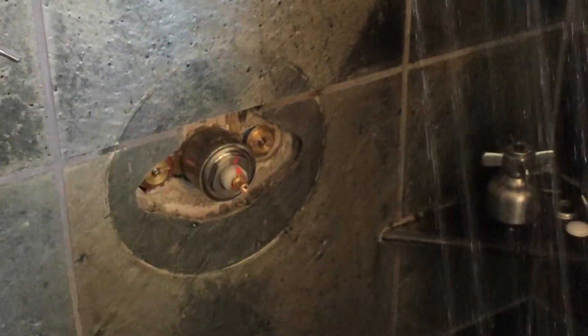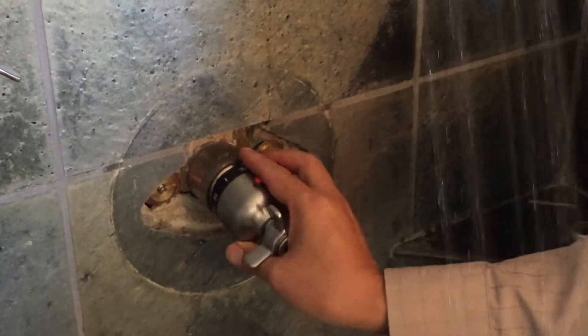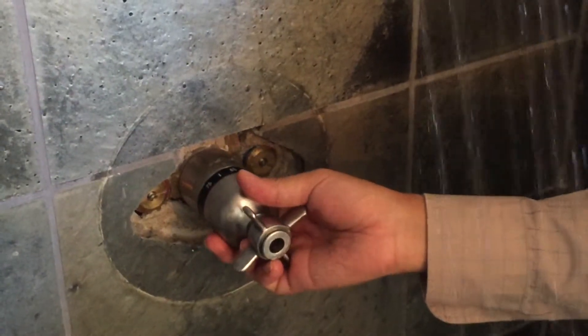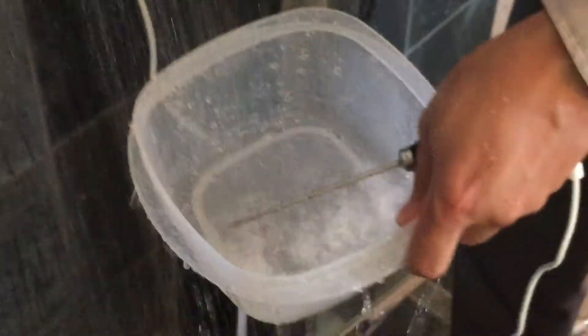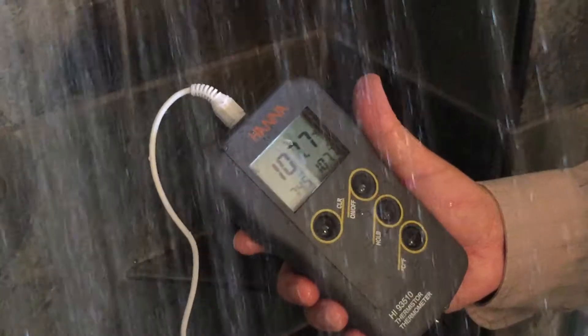So maybe just a slight turn a little bit further in the clockwise direction — just a little tweak — using the trim fitting to engage the cartridge to rotate it. Collect the water again against the thermocouple and see we are at the respective temperature.